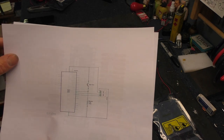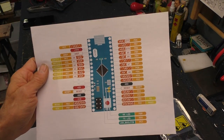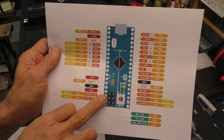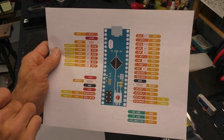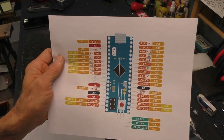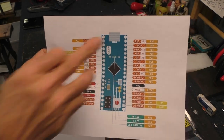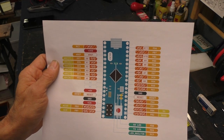That's all there is to the parts. Here's the pinout for the microcontroller. On the VIN I can power this with up to 12 volts and the onboard regulator will take care of the rest, or I can just run it off USB. To start out with we're just going to run this off the USB cord, which is five volts.